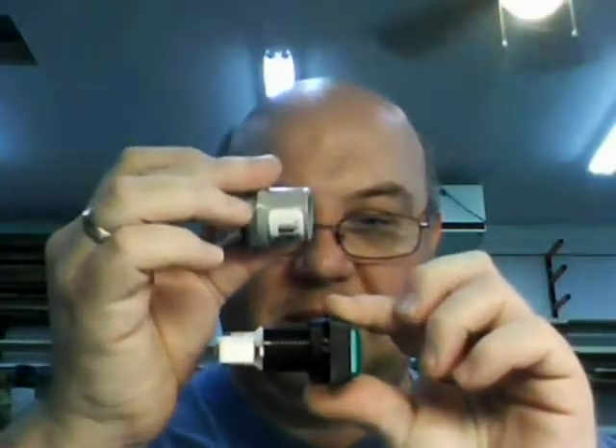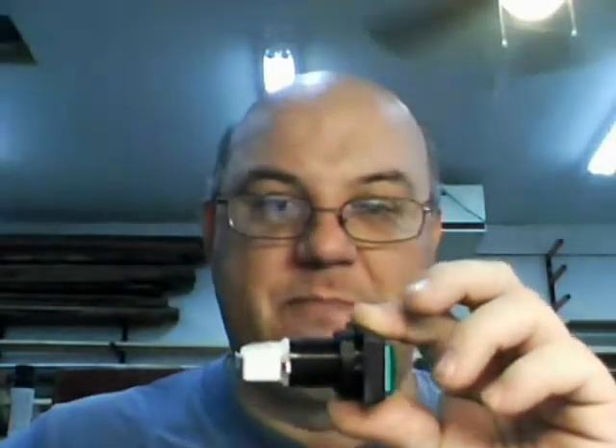The other reason why I want to use this coupling is that the prop's original design was to use a push button switch such as this. This is an arcade push button from SuzoHap that fits into a hole in the project and happens to be about the same diameter as the coupling. So by using that coupling and just press fitting it in, if I decide I want to go back to using the push button, it's a simple matter to remove the controller, put the push button in place, and with a little bit of code change we're ready to roll.